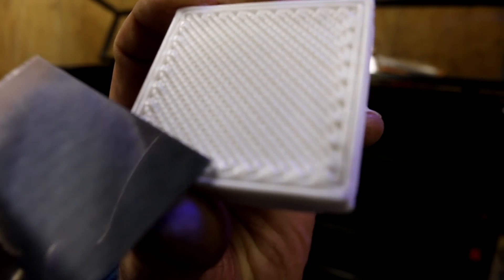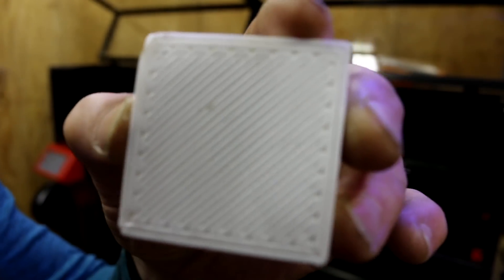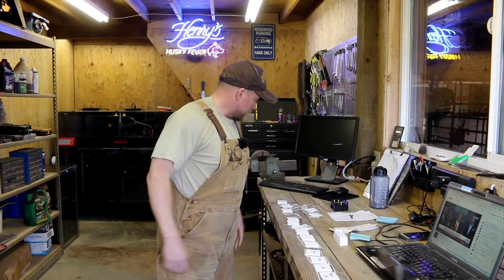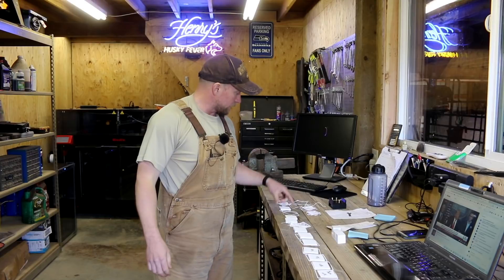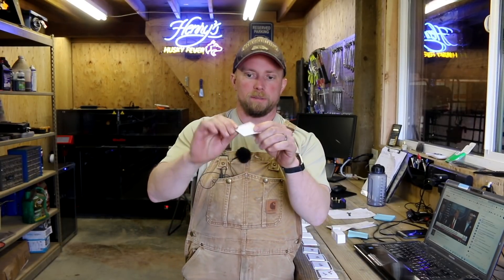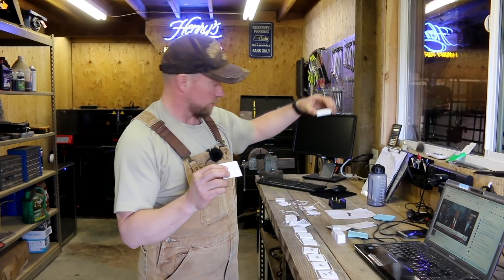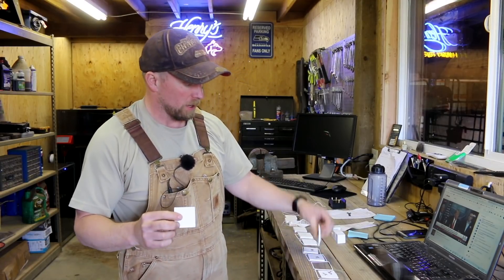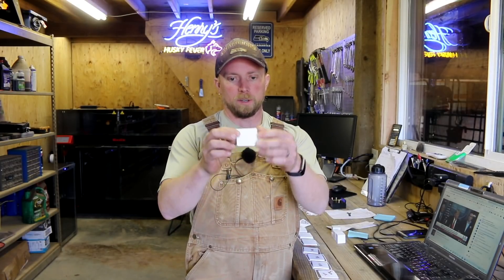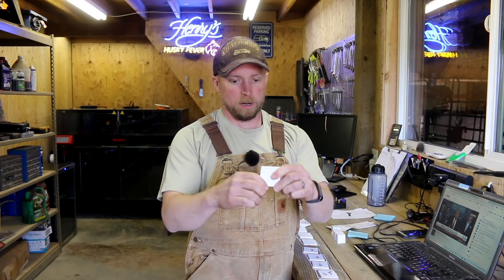I'm not a big fan of those edges right there. There's still too much spacing and lines in between. Let's count them up — one, two, three... does that even count as a test?... all the way to twenty. Took us twenty tests to get to a very nice actual thickness. When I designed the walls, they were going to be quarter inch thick — way too thick. Dropped it down to eighth inch thick — still too thick. And now we're down to a sixteenth of an inch here, which is a very nice thickness, very strong, very sturdy. Could almost go down to a thirty-second.